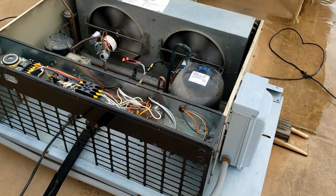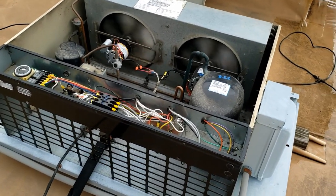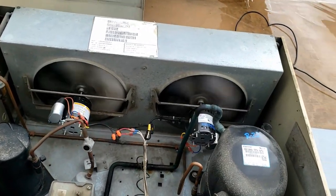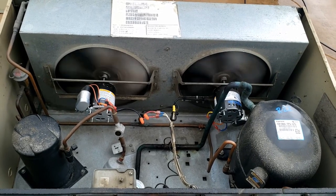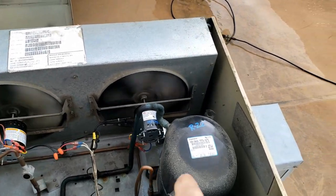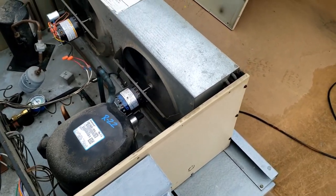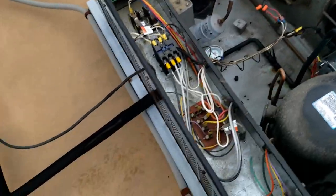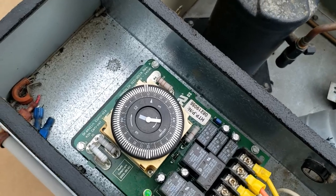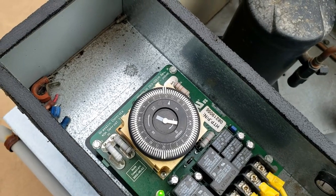Today we've got a walk-in cooler that was getting a little too close to comfort for warmth. I get here and it's about 37 degrees. They said it was 39 and a half earlier. It wasn't calling to run - the thermostat's mounted right on the side of the evaporator. I kicked it on; suction pressure is looking fairly decent, sight glass is full, and we haven't gone into a defrost lately. It's only set up for 30 minutes of defrost, twice per 24 hours.